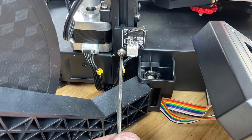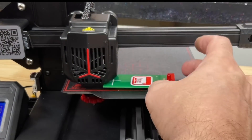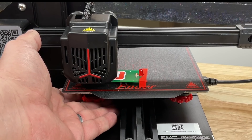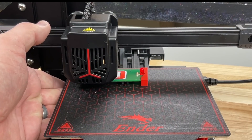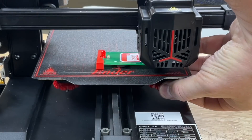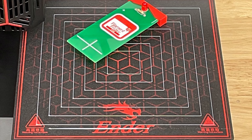Leveling the bed, I did have to lower the Z stop almost all the way down to the bottom to give enough travel, then I ran my G-code to position above the adjusters. This automatically lifts the 5.8 millimeters that my tool needs, and I went around to each corner and adjusted until the light just came on. Once I got all four corners set, I ran the square test — which I made for this bed size — and it came out perfect. I'll put a link to all this in the description below.